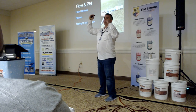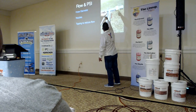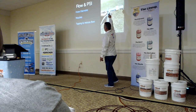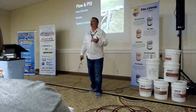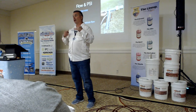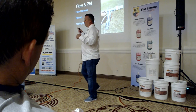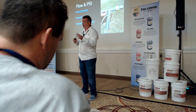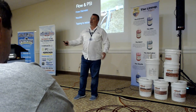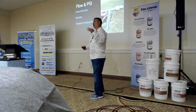So you can tip it down, and we didn't tip, and I wish we had, but you can see this adapter that I built for mine, and a lot of people have them now, but I can put whatever orifice size pressure washing tip in there and reduce my flow, because I can go all the way down to 1 if I want to. It just has to be doing at least 1. On my particular pump, I can go as low as putting a 10 orifice in there, 15 degree, because I'm using that garden hose nozzle, the pattern opens up later, keeps it off of me, opens up where I need it. I like the 15 degree. But with a 10 orifice in there, I can bring my GPM down to about 2.5, 2.75 GPM.